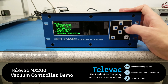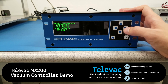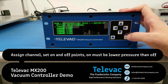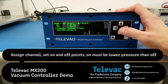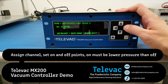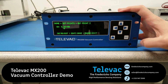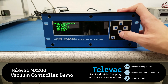The last menu we'll look at is the set points. This unit has a single relay set point board attached to it, so there are four set points available. First, you have to assign a channel to it — let's select channel 2, so now channel 2 is saved for set point 1. Then you can go into the on and off values for the set point, using the left and right keys to scroll between digits and the up and down arrows to adjust the value. Press the home key to exit without saving, or press enter to save. This can be done for all set points individually.